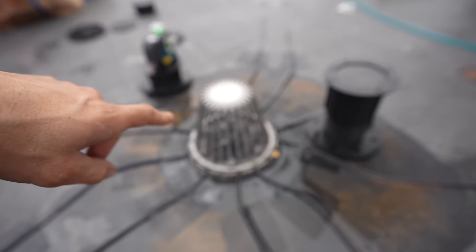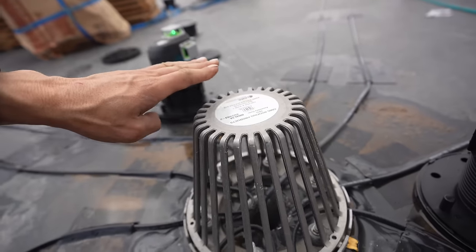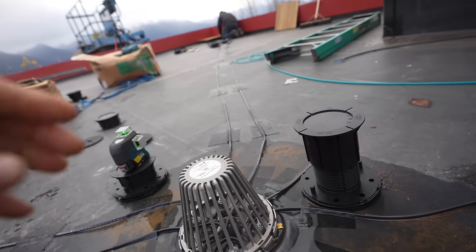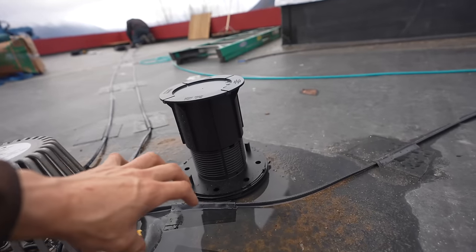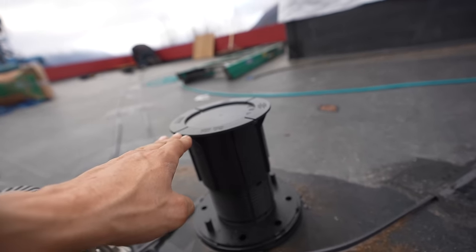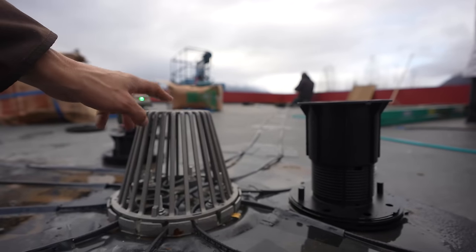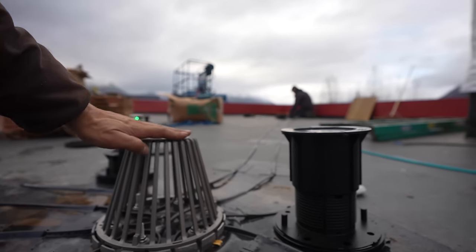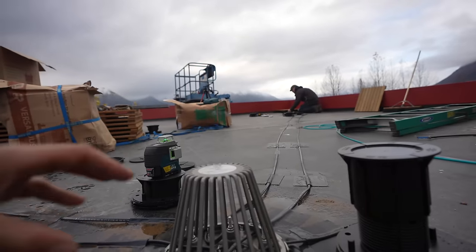The first thing you want to do is go to the lowest part of your roof, which in this case is the flat top roof drain. Set your laser up just above that so your deck won't hit the drain cap. When you set your laser above that, you get your tallest pedestal and screw it up until it meets the laser. The top of the tallest pedestal is just above the rooftop drain leaf guard, so the deck will float over it and won't hit the drain guard.